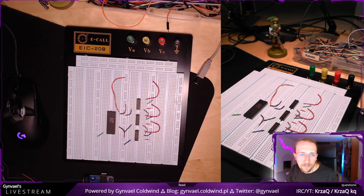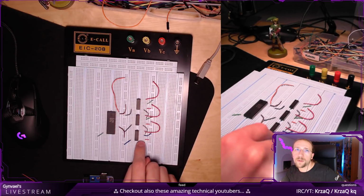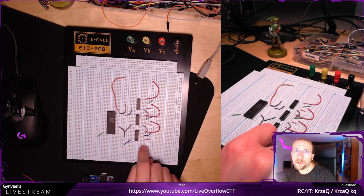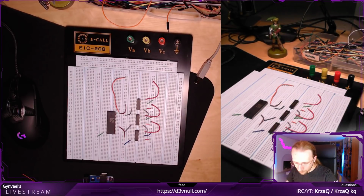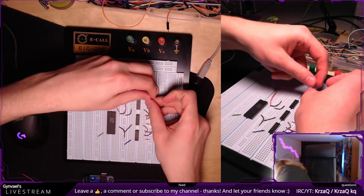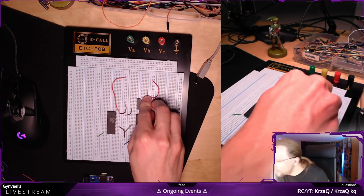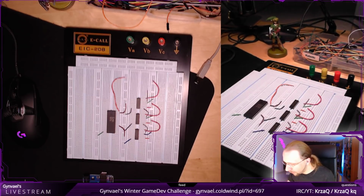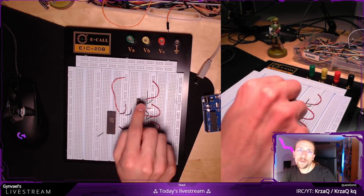And then here, because this QH apostrophe here will be floating, not connected to anything, we can leave it floating according to the datasheet, as we read. So that's fine. Then we need to connect serial here to Arduino, and I'm actually going to just go with it somewhere high and connect it later. So that's the third one, and the third one is going to go here. So later on, I'm just going to connect Arduino to here, and this is going to be the serial input. Because it's lying here, right? Then, okay, so this is the serial.